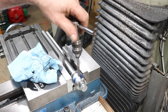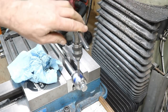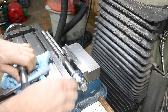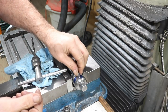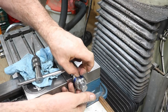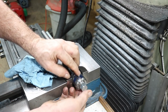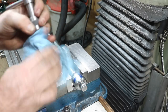Lots of oil, and check often. I've hardly done anything and let's just see how much that goes in there. Look at that — I hardly did anything and that's almost there already. Actually, that is probably done. It didn't take much to cut that. The reamer is nice and sharp and it's going to be there.